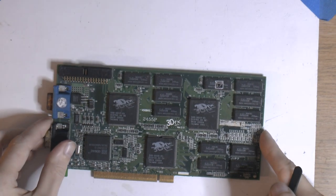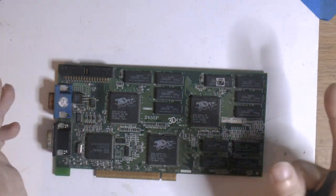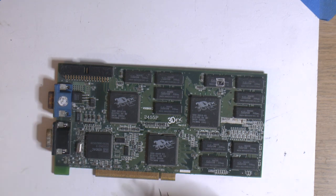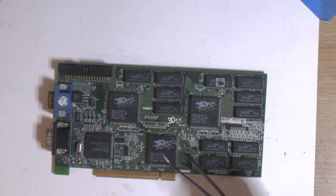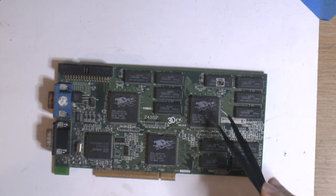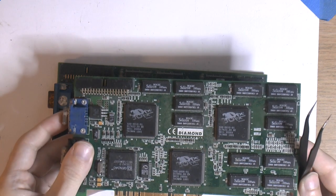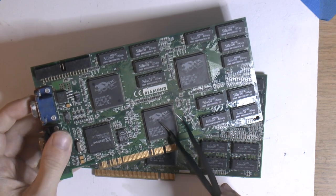which would be this one then. And I think we start with this one and remove those two TMUs and this FBI chip because they're all junk. So clean this card up, and the reason why is I want to find out if the pads are intact, where they're missing, so I don't have ripped traces like this one. So yeah, I think that's the plan, and then try to get the TMU, the right one off here, and put here, and get this TMU, I think this one here, and put on here, and also get this FBI here.